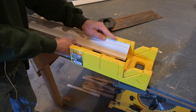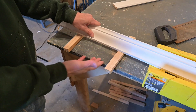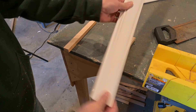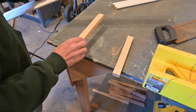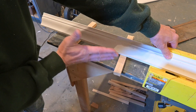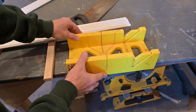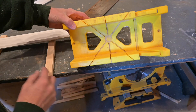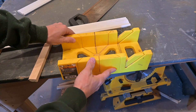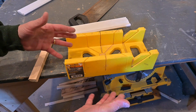So that is what I'm going to do. I'm going to get this where I need it to be, take a quick measurement here, and put a scrap piece of wood in there to keep this from moving. It's also important when cutting manually to support the end here because we're going to be doing a lot of physical motion. If this end is moving about, that's not going to be helpful either. So I have a couple pieces of scrap wood here just to support the end so when this is in position, it's supported on both ends. Another problem is that the miter box itself can be moving around. You'll notice in this version there are some screw holes right here — this is meant to be screwed down to a surface. Another way to do it would be to clamp it down, which I may do here. But you need some method to hold this in place so that it doesn't move around on you.